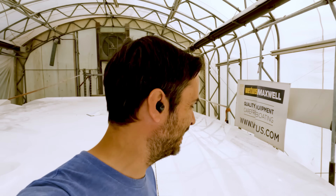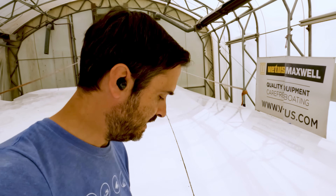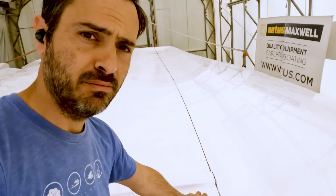As we said in a previous episode, we have learned that we do need to fair these out properly before we put gel coat on it. The thing that really got me through this process of making sure everything was aligned is that the majority of this is going to have either solar panels or non-skid on it. Non-skid hides a lot of sins, so anything that's kind of uneven that normally you would see in a reflection is going to be non-skid basically from this point aft.